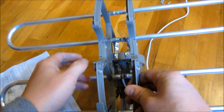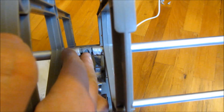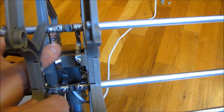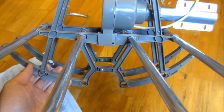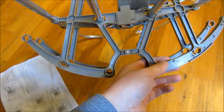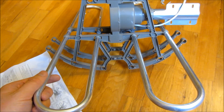I've pushed the rod through along with the connector. I want to give you a close-up of the adapter — I have the plastic adapter here, and what I'm going to do is screw these connecting pieces — basically these aluminum strips with the hole in it — that connect the base to the antenna into this hole. Let me give you an angle view — I'm simply going to put two screws in there. From the side, this is what I've done on the inside; it's not on the curved part — the curved side is just those shorter pieces — whereas this comes from the inside.